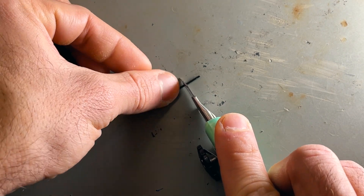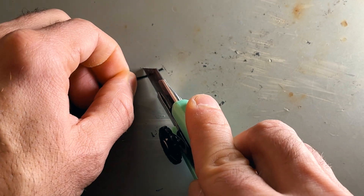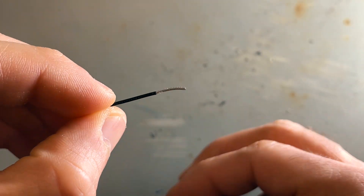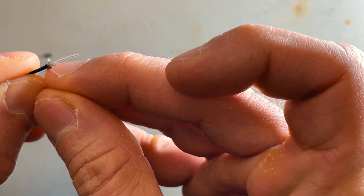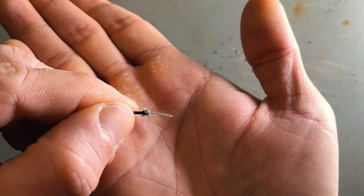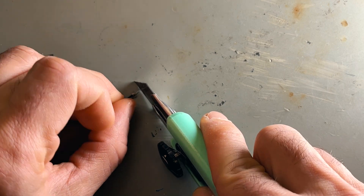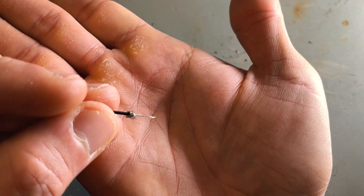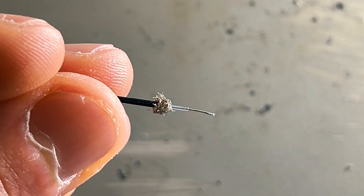The process goes like this: you have your antenna — a regular ExpressLRS antenna — you cut the UFL connector, and then you peel and remove the outside cable to expose both the negative and positive parts of the antenna. The best way I found to do this is using a very sharp knife, pushing against my ESD carpet and rotating the cable to cut through it, then carefully pulling with your hands or nails. You have to be careful because these antennas are not very strong and can break easily if you push or pull too hard.